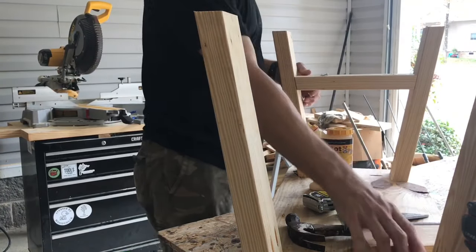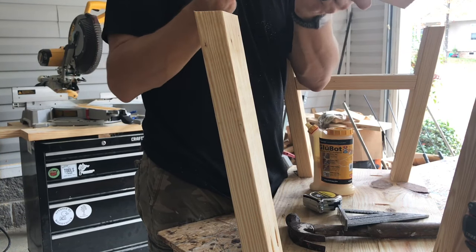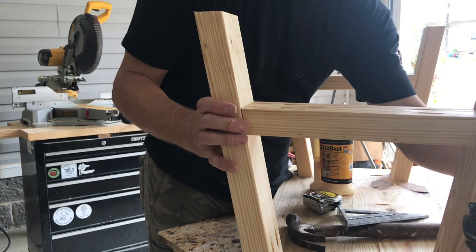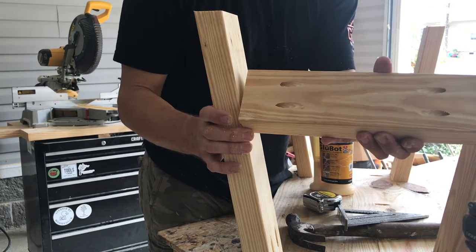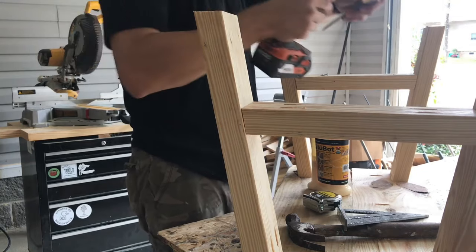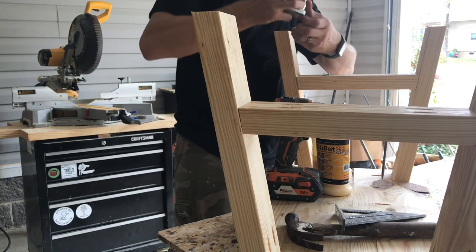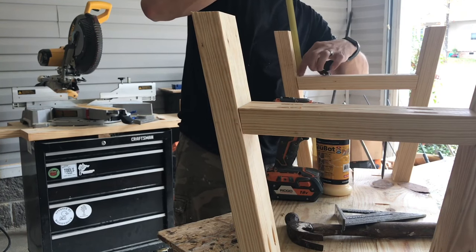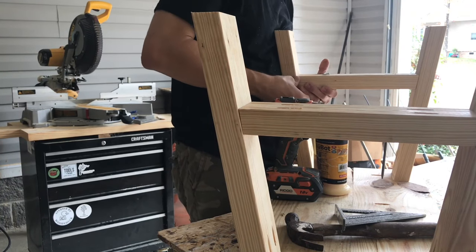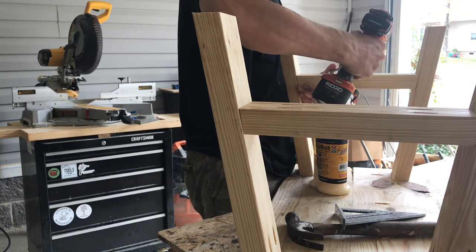So this is our bench upside down. I've got 12 inches from here to here — outside or long edge to long edge. You can see that this angle will match these two legs. I've got pocket holes drilled on the bottom, which will be the bottom when you flip it over. I have a right-angle bit to make it easier. I measured five inches from the bottom of this piece to the bottom of the leg on each side so we can keep everything nice and square. This right-angle bit will help you out if you're using pocket holes.